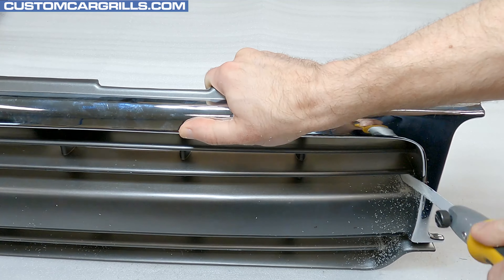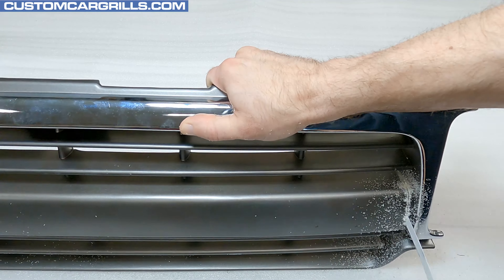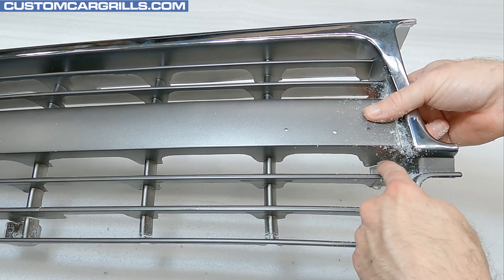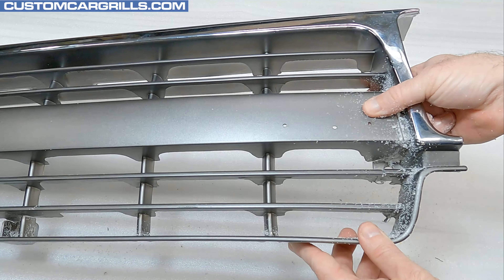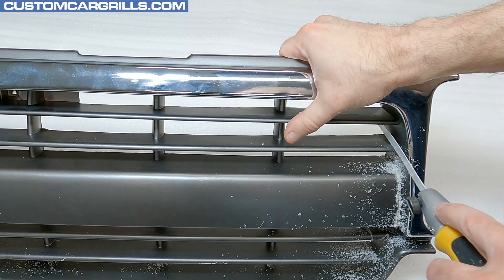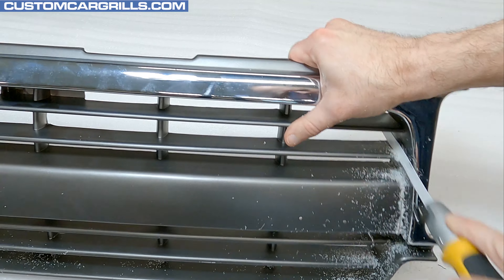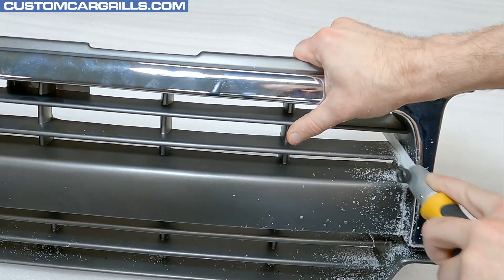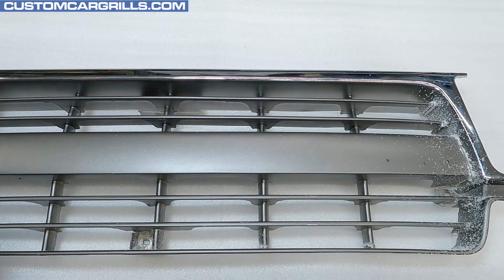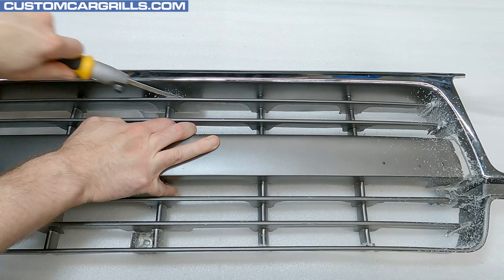From there, I'll take a top-down cutting approach, getting close to the edge, but staying maybe an eighth of an inch away so that I don't cut into the edge itself. At this point, the side mounting tabs should still be attached to the outer frame, but free from the bulk of the inner area. It's time to knock out the rest of these connecting bars and get the center out. There's just a handful on the upper sides and top edge. While we are preserving the lower and side mounting tabs, the one on the top edge needs to be removed. I'll just simply make a cut right through the tab with the saw and that will be the last cut on this step.